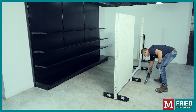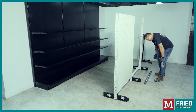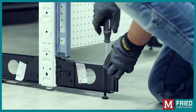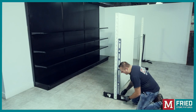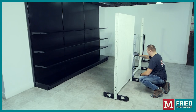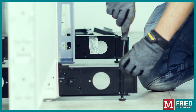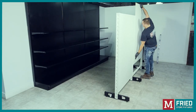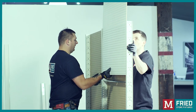Using a leveler, find the highest point to start the leveling process. Then use a flat screwdriver to level the base shoes. Make sure to level from the upright. Once everything is leveled, go ahead and slowly slide in the rest of the boards.